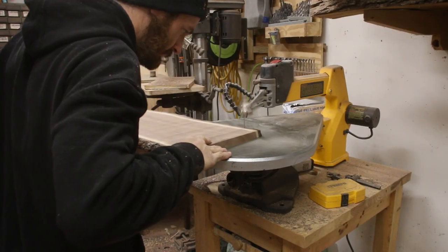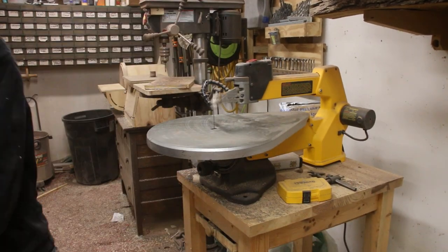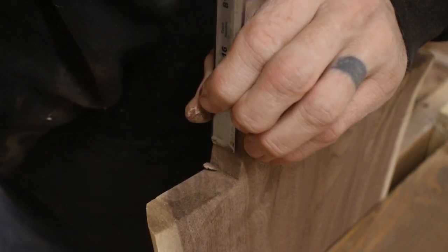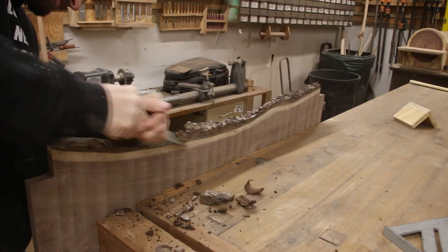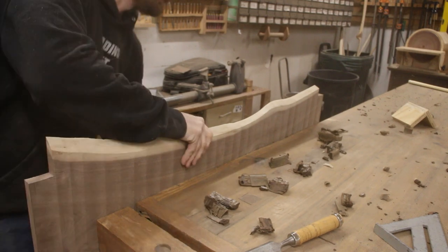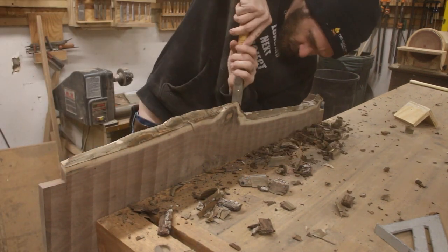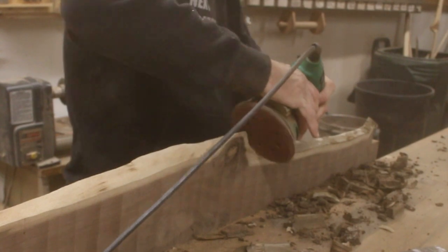Because of the way the shelf needs to sit inside the base I had to cut notches into the shelf piece so it would fit nicely. After cutting the majority of the waste off with the table saw I cut the notches with the scroll saw, then fine-tuned those notches to a five degree angle with a sanding block and a chisel. One of the biggest reasons I chose this piece is because on the other side of the slab there's a beautiful knot that's going to stick out into the walkway — it doesn't stick out past the table any farther than the top does, so I think it adds a beautiful aspect to the entire piece. I spent a ton of extra time working on just this knot section alone so it would look perfect.